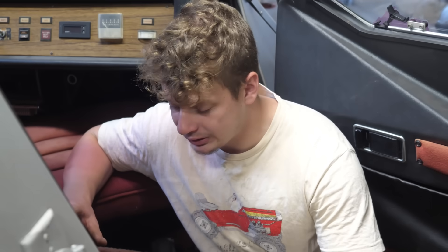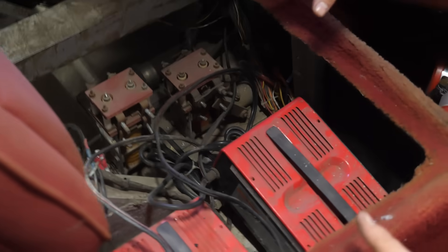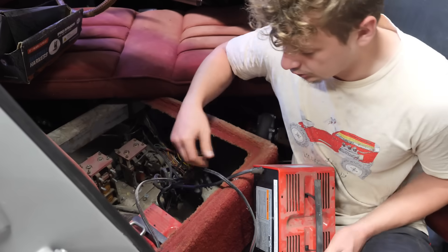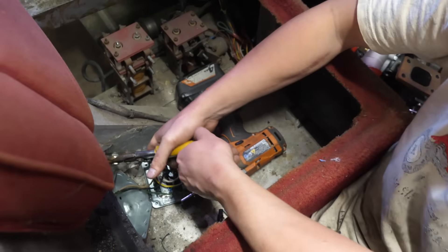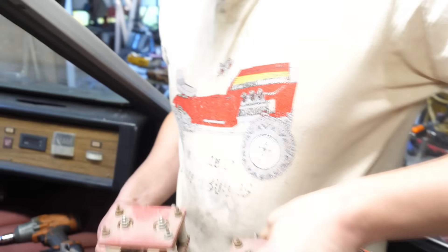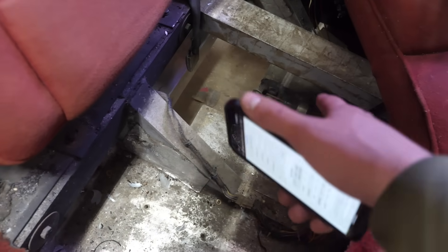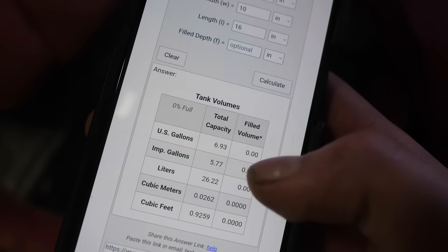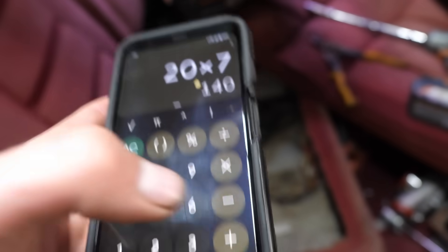While I wait on my rear end parts, I figured I'm gonna build a gas tank. I think the best place to put it is under the seat — the battery's gonna be on that side. I'm getting rid of all this electric stuff; I'm assuming this is from like 2002. This is where I want my fuel tank right here, and we could always do one on the other side as well to equal it out. I calculated it and it's gonna be 6.9 gallons, which should be about 100 to 150 miles range.